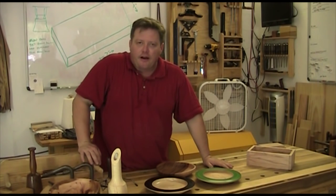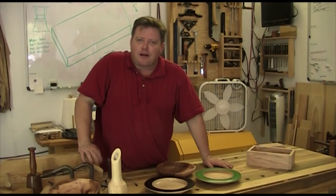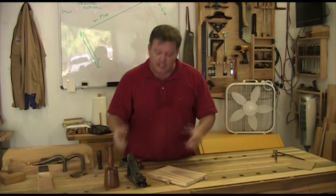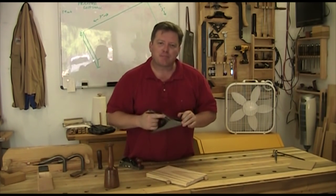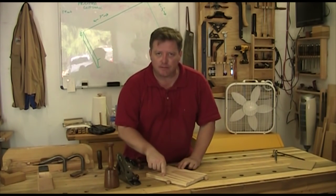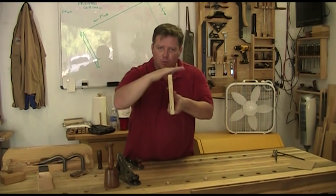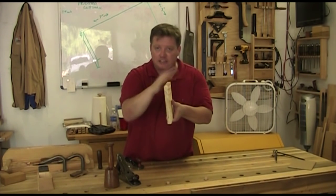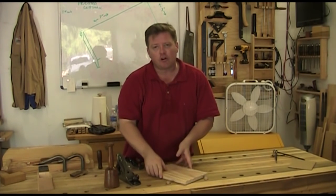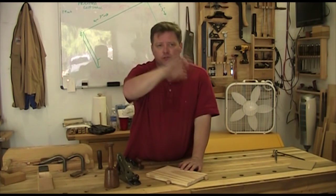For our little discussion, we are going to talk about something that I think is a cure-all for a lot of problems my students have with hand planes. A lot of beginning woodworkers just getting into using hand planes seem to have problems with the results — they don't like plane tracks in the boards, or when jointing the edge of a board, it starts to get cambered one way or the other, sometimes slanting as it goes through. A lot of those problems can be solved by introducing a bit of camber into your plane iron.